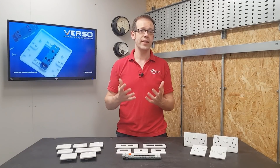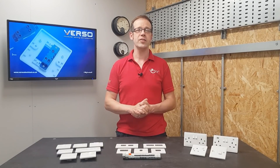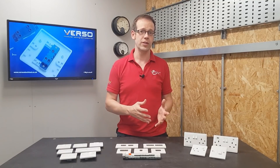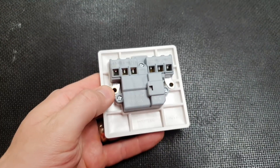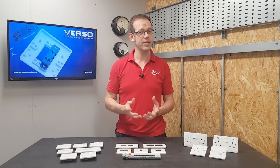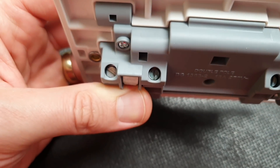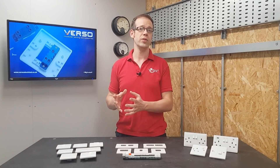The accessories are tested and certified to the industry's highest certifying body — Intertek standards — and they are also supported by a lifetime guarantee. The accessories are manufactured from the highest grade urea, which has antimicrobial qualities, which is very reassuring. There are also lots of features on the non-modular accessories that normally only feature on the more costly end of the market, such as terminals all in line with each other on the back of the fused connection unit, meaning you don't have to keep flipping it around when installing it. Adding to this large terminals and screw heads to make connections easier, along with captive screws that won't disappear on the floor when backed out, and you've got a range of accessories that will leave both the electrician and the end user really satisfied.